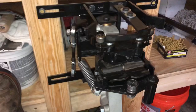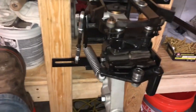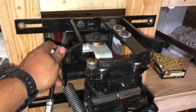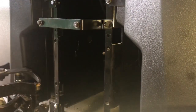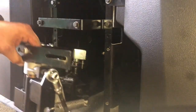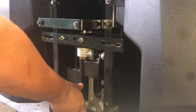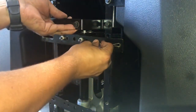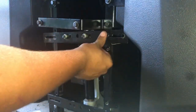You've got to keep everything dry so that this cam follower can't slip past — that's why it's dry — so the cam follower gets locked on these when they're down like it's supposed to. Other than that, that's all there is to it. I kind of threw this together real quick just to check this thing out, but I think this is a pretty good angle to look at how it works. To put it back in is real easy — just make sure that arm's up where it's supposed to be. There are four bolts, one in each corner.